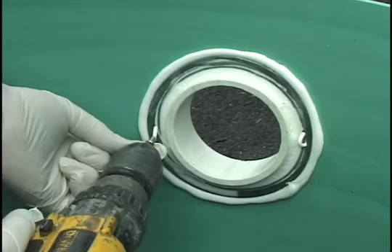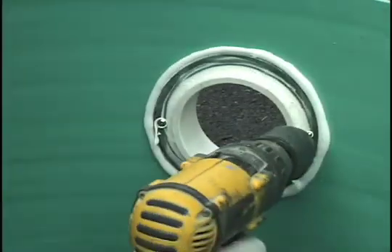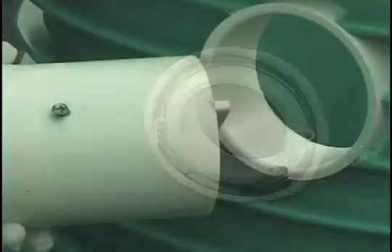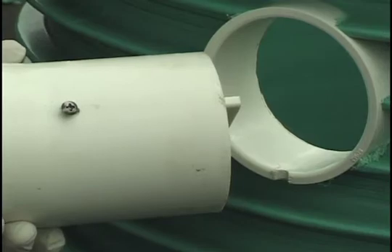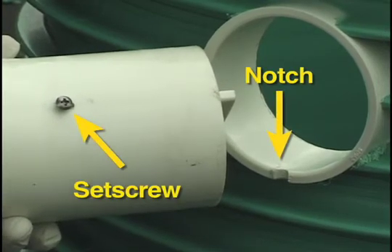You may need to hold the coupling steady while the adhesive is hardening. If so, insert the short stainless steel screws that are supplied with the RSV into the small holes in the flange, and drive them through the flange into the riser. The next step can be completed before or after the riser is installed on the tank. From the outside of the riser, insert the split-flow T into the coupling so that the set screw in the top fits into the notch in the coupling.